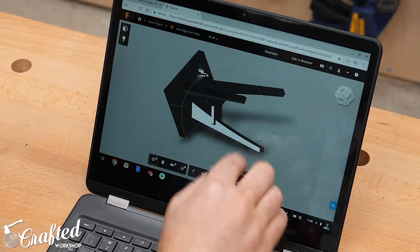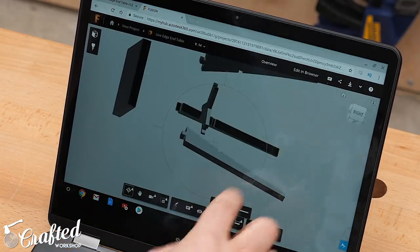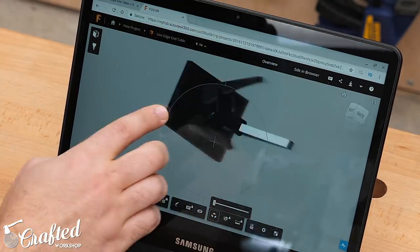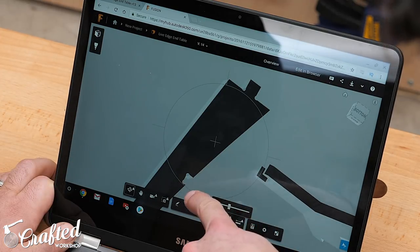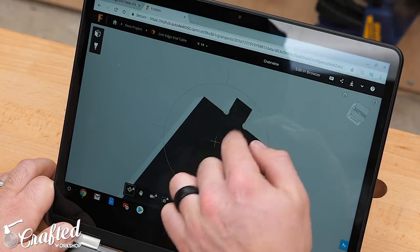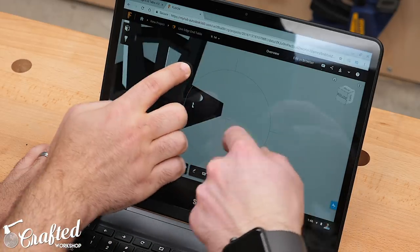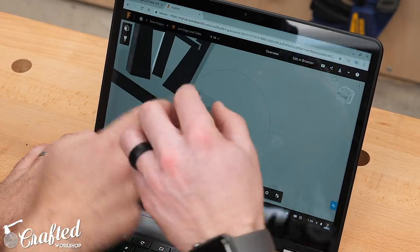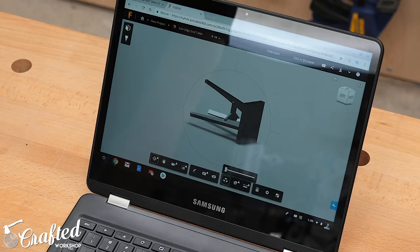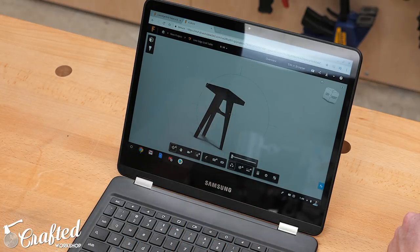Now that we have it all designed we can see how the joints go together. These mortise and tenons will plug into the top, and when it's all assembled the weight pushing down will want to spread the legs, and this piece will hold it in place. Anywhere these joints connect, since a router bit is round, we need to add what are called dog bones — these little areas allow the router bit to clear out the waste, which essentially gives you a square corner that things can join together. We also modeled in the wireless charger: the disk of the charger itself and where the power supply protrudes. You could sub in eight-quarter lumber rather than double-laminated three-quarter ply, and use the same leg design swapping out the top to make a bench or a stool.